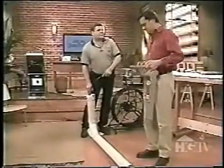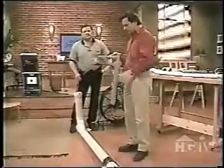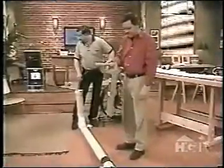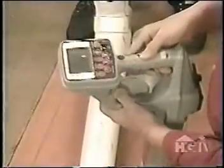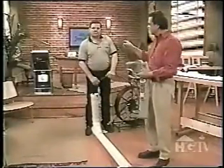And it has a radio transmitter on the end of it. So whatever we're looking at in the line, we can always go through and identify where it is. You hear that beep — as we walk over it, that tells me exactly where it is. Push the right buttons and it'll tell me how deep and everything else — the depth and the exact location. So if we ever had to dig, we know right where to dig.